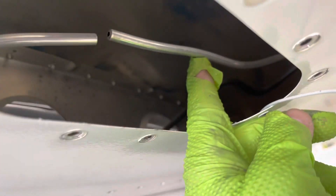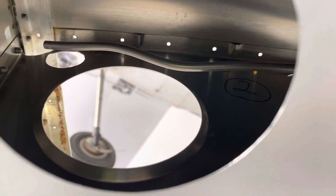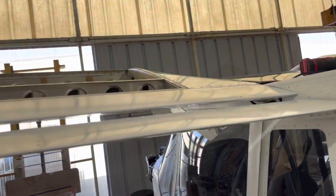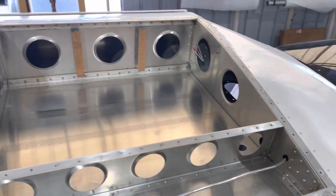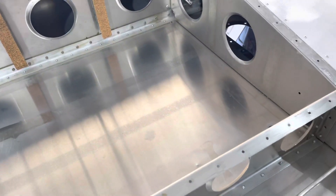We have access here — we're going to join these pieces together right here, then it goes back through a grommet and eventually ends up at this inspection hole, going into the tank with a ferrule and a fitting. It just kind of crosses the bay after where the fuel tank sits. Now we're ready to put the tank back in — put some cork, rivet everything back down. Make sure you clean this really good, because even a tiny little piece of rivet will chew a hole in your tank.